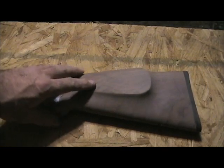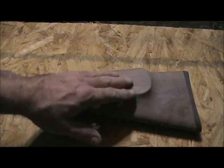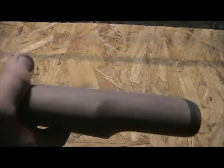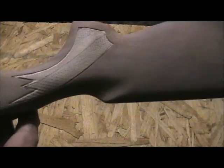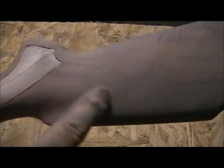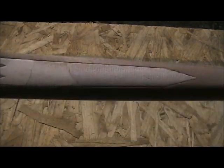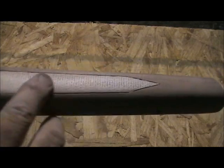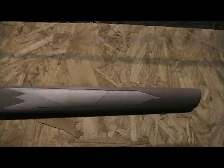Now I've got all of the surface of this rifle stock sanded to a very fine satiny texture — it's very smooth and I pretty much got all the scratches out of it. Make sure you keep your masking tape on your checkering while you're refinishing using any kind of oil finish. That's a final step after everything is done — you want one light coat of oil on your checkering pattern just to seal it and that's all. So let's go ahead and put the first coat of True Oil on this piece of walnut.